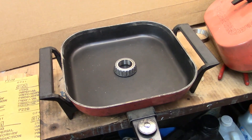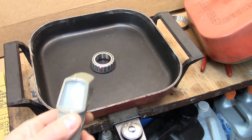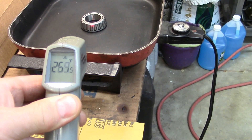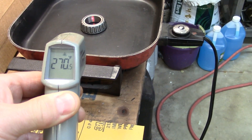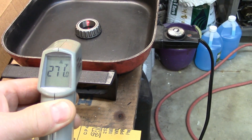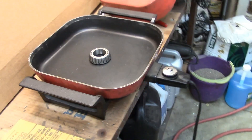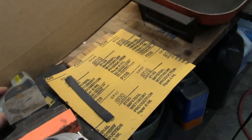It's been in the cooker about 8 to 10 minutes. If you want to know the exact temperature — we're running about 253 on the inner race, since that's what's touching the pan. I really want to get it up to about 270 on the inner race, and I like to get the bearing up to about 325 to 350 overall. That way you don't have the risk of it going on partially and then getting stuck — where you can't get it on and can't get it off.